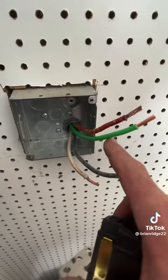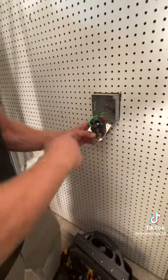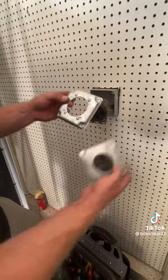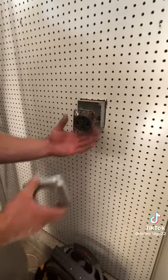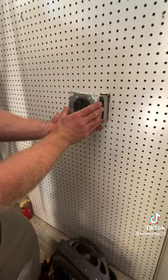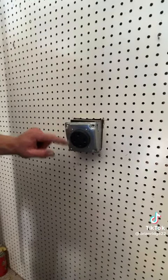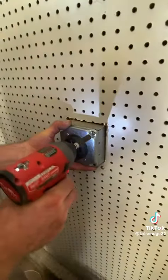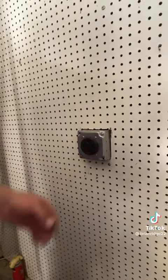Now that I have the correct size ground, I re-stripped all the wires so they have nice clean ends, and I'm going to install the new outlet. These Bryant outlets have their own cover — it's bigger and not the same as your standard NEMA 14-50 outlet. The outlet installs to the cover with four screws, then installs to the box with two screws on the perimeter. I finished the connections and the ground, and put the covers back on.